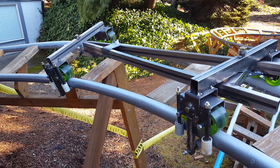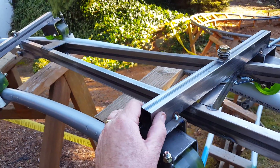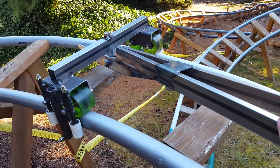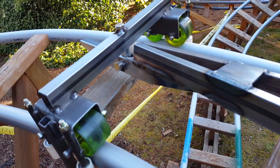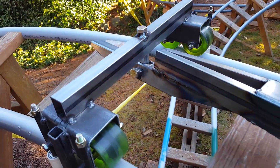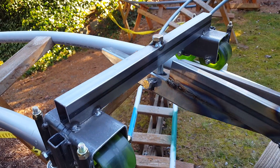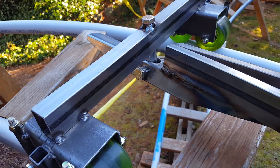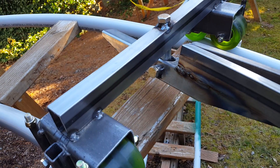You can see how low this frame is and how the aft and forward bogies pivot. Especially the front one — you can see how it pivots in that spherical bearing. Right now it has about 17 degrees of freedom forward, aft, and left due to the spherical bearing. The right side is only about 13 degrees, so I'm probably going to have to open that hole up a little bit where the spherical bearing goes down in.